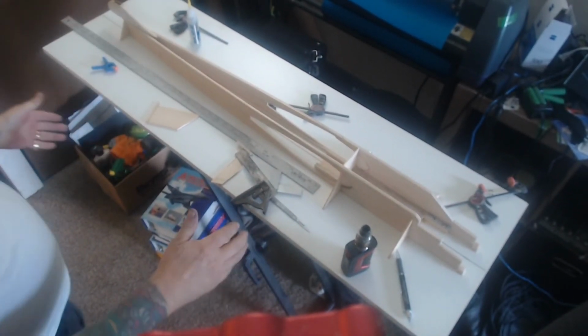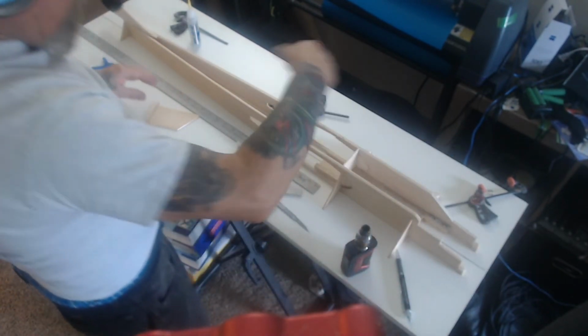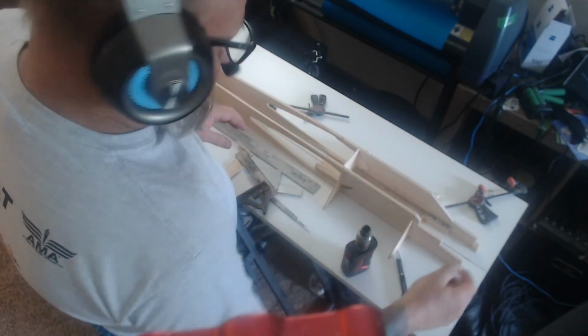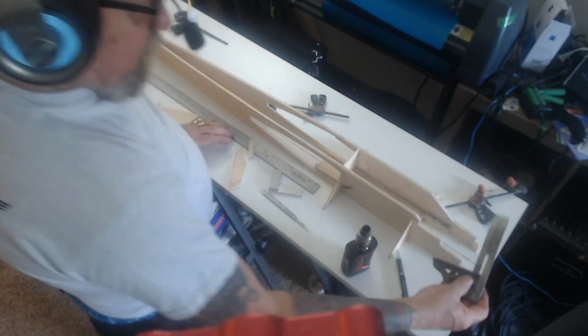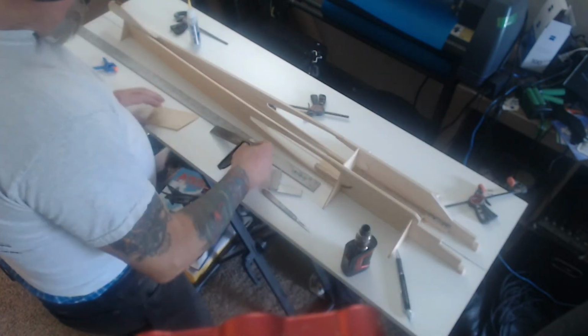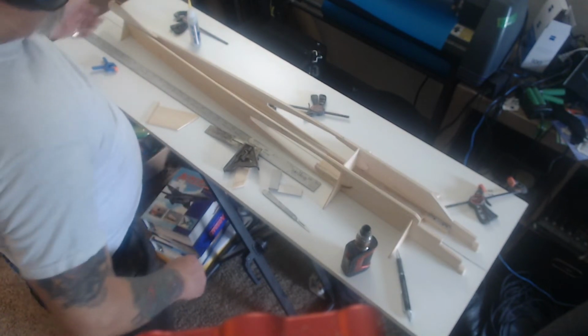That's the jig layout. It's real simple. Straight line, center line on the crutch. Pull it together, stop it, square it at the front. Make sure that the fuselage is equal across the nose. Bring the tail back to center line equal.